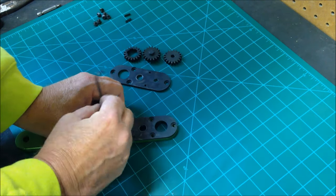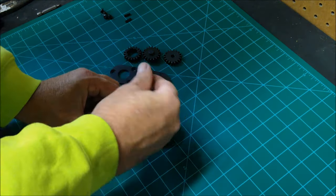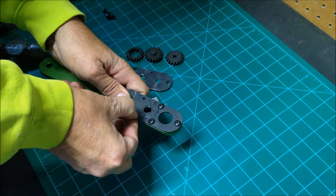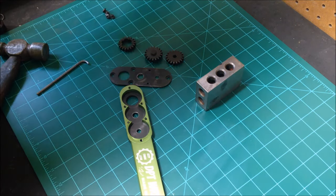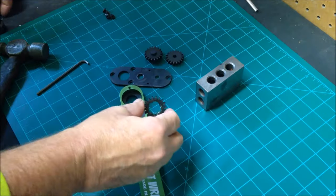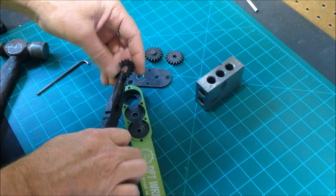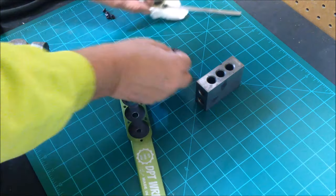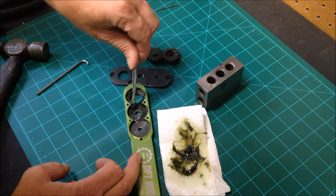Okay, let's go ahead and assemble one here. The aluminum handle on the wrench has a type 2 anodize on it, which makes it a little bit tougher and a little more scratch resistant. All the steel parts, the backing plates and gears, have been hardened and black oxided. After anodize, I take the handles to the laser etchers and all the lettering is laser etched onto the anodize.